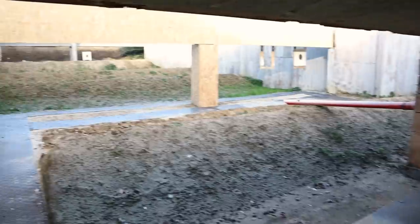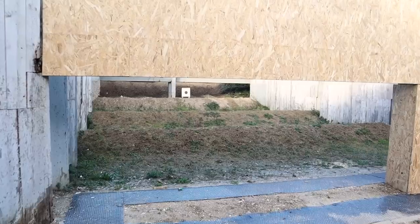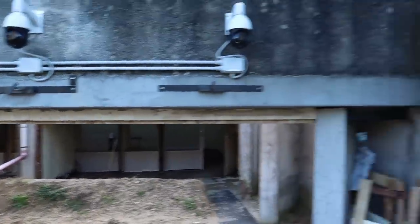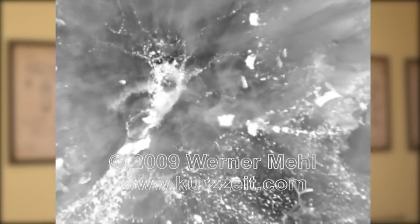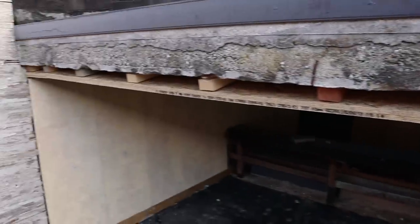The baffle is basically just a brick wall suspended on three pillars and a couple of beams, and has the purpose of intercepting abnormally high trajectories. The lowermost couple of inches get frequently hit by inexperienced shooters, so the concrete beam is placed a little higher than that, and some AR500 steel hanging down does the dirty work. Even the concrete beam, which sits higher, is protected by AR steel, since getting load-bearing frameworks destroyed over time is quite unpleasant. And what about the wood? It's certainly not there for stopping bullets, but for capturing shrapnel and debris. Whenever a bullet impacts a hard surface, it gets broken into shrapnel that is still moving quite fast and represents a danger, mostly for the eyes.